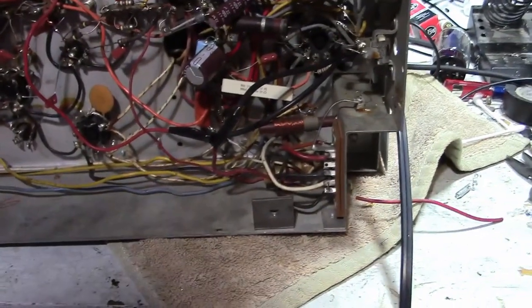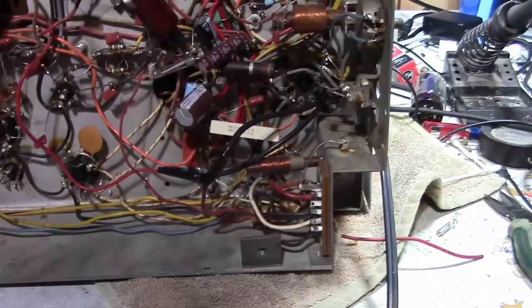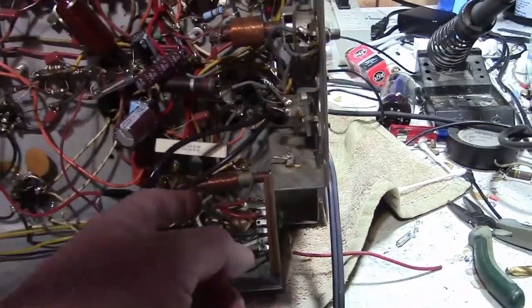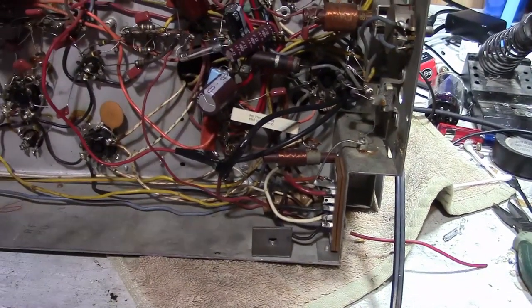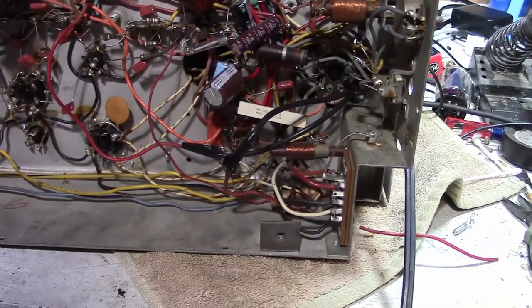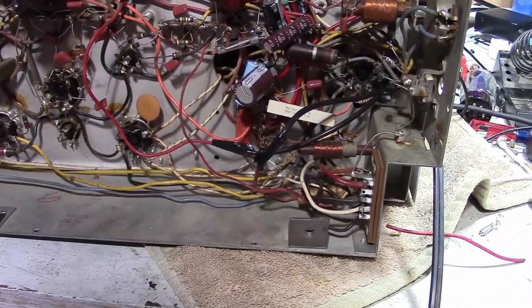However, width is something you rarely need to mess a whole lot around with, and even when you do, it doesn't change the width very much. It's made for just a very fine tweaking. Same with the linearity coil nearby. Replacements do show up on eBay now and then, and I probably got some I've scavenged, so I'm not too worried about that. More worried about more of these ugly repairs.